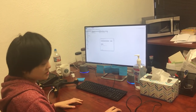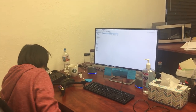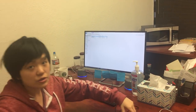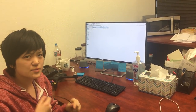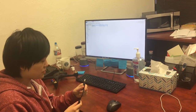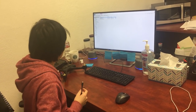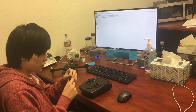Now let's move on to the RX or receiver upgrade. I'm going to shut down this tool and unplug the Android mini USB. The receiver part of the upgrade is a little more finicky than the transmitter or flight control part. You're going to need to change USB lines — now you want the micro USB. First, you're going to use the micro USB to connect the transmitter to the computer.